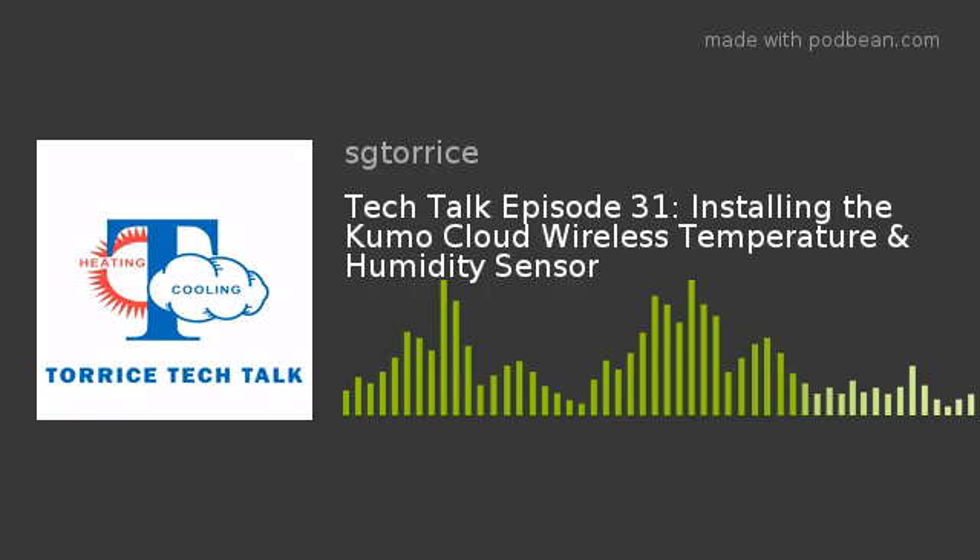This is Kumo Cloud only, but it's a great accessory to have and is really going to help your system run at optimal levels. This accessory is used with the Kumo Cloud wireless interfaces and will also tie in at a later date to the Kumo Station. What this sensor allows you to do is remotely sense your temperature and humidity in a space. It comes particularly in handy if you have a wall mount type unit that is up high and you want to sense the temperature down lower in the space. This is used with all indoor units, and it can also tell the Kumo Station what the humidity is in the space, and it could actually activate a humidifier or dehumidifier.